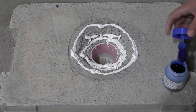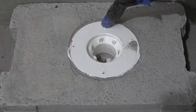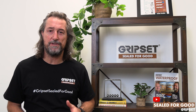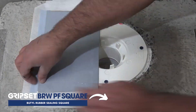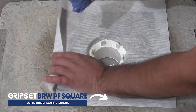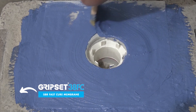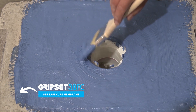When you're laying your membrane system it is very easy for water to run into that flange once the tiler has put his bed down and the job is complete. How to waterproof a leak control flange — a puddle flange? With the Gripset system it's quite simple. Whether using a liquid membrane or a sheet system, the best way is our BRW butyl squares. They are an instant application — they bridge the edge of the flange to the floor surface, which is the most critical area. We don't rely on sealants or fillers; it is waterproofed immediately, and the beauty of those butyl squares is that they form a permanent bond, which is what you want. It's totally sealed and then you can continue on with the liquid membrane system.